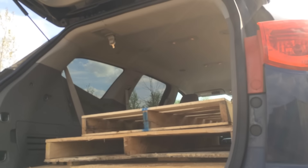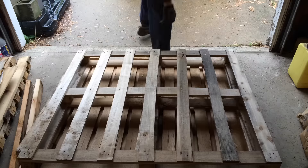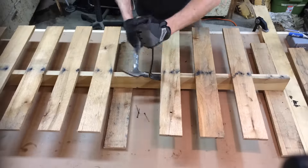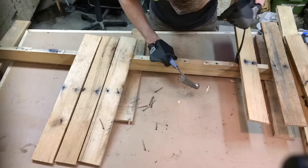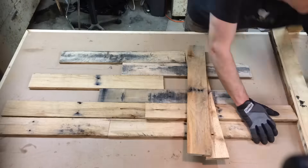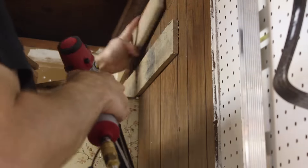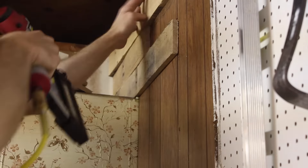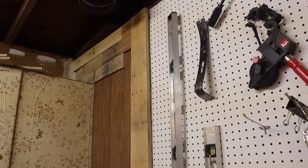In keeping with the almost free nature of this project, I decided that the thing I would use to create the look and feel of the back wall was a pallet wall. This is a project that's been done before in homes and workshops, and there were some great links I found on places like Pinterest that gave me a chance to pre-visualize what this would look like. Tearing down pallets is really difficult and time-consuming work. I've been settling on the process of cutting off the side rails with a circular saw, and then basically using a pry bar and hammer to pry off the slats, which were primarily what I wanted to use to create the pallet wall. I had just gotten an 18-gauge brad nailer from Harbor Freight a few weeks before starting this part of the project, and this ended up being a lifesaver.